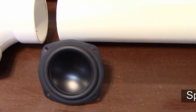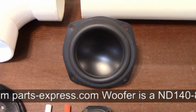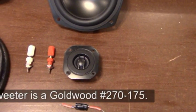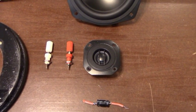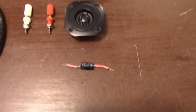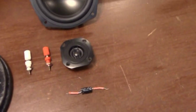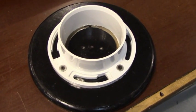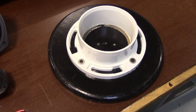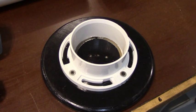You're also going to need a speaker. This particular speaker is from Dayton Audio — it's the ND140-8, a very nice 5-inch speaker with a neodymium magnet. It can handle a lot of power and has excellent bass response. We also have a half-inch diameter dome tweeter, again from Dayton Audio — this is a Goldwood tweeter. Next to the tweeter you see two banana plug jacks that we're going to install on the base of the main 38-inch tube to bring our leads in. We also need a 4-microfarad crossover capacitor. The other major component is the base — a 3-to-4-inch closet flange mounted on a 12-inch diameter piece of 3/4-inch plywood. The pipe just snaps right into that during assembly.